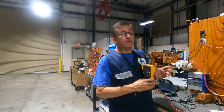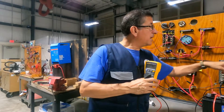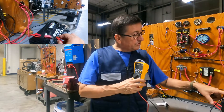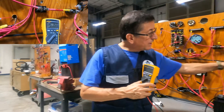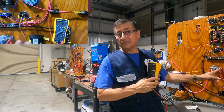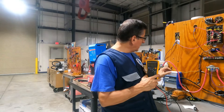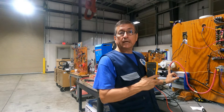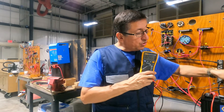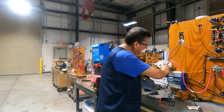Where should the maximum voltage drop be? The maximum voltage drop should be here — because the current travels from the positive of the battery into the battery switch selector, then into the crank relay, and then here. If you check the voltage between the positive of the battery and the battery switch selector, it's exactly the same; between the input of the relay, it's the same — no voltage drop. Now we are going to check the voltage between the positive of the battery and the positive terminal of the solenoid of the start motor. The negative of the multimeter should be connected to the negative bus bar of the battery, and the positive probe connected directly at this point.